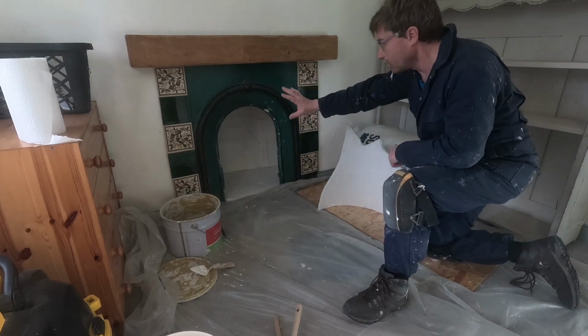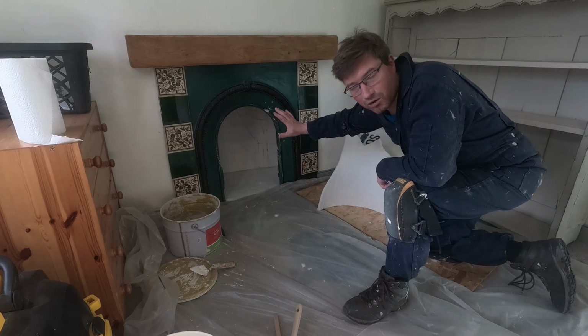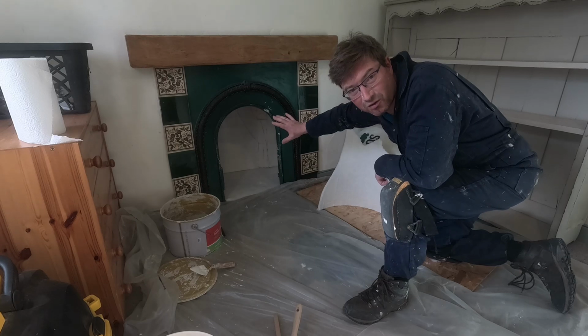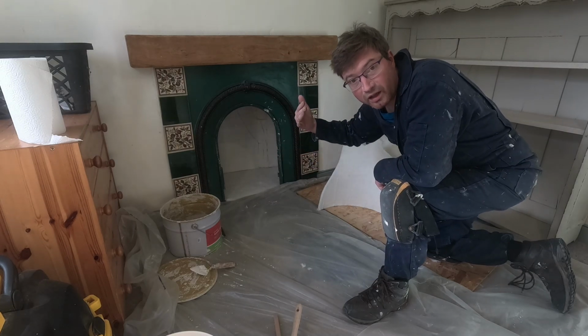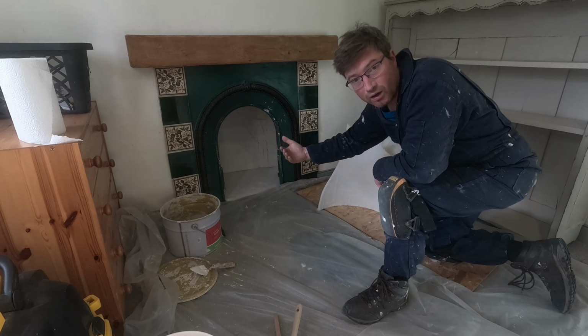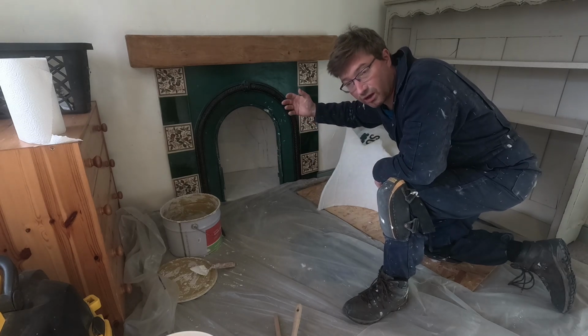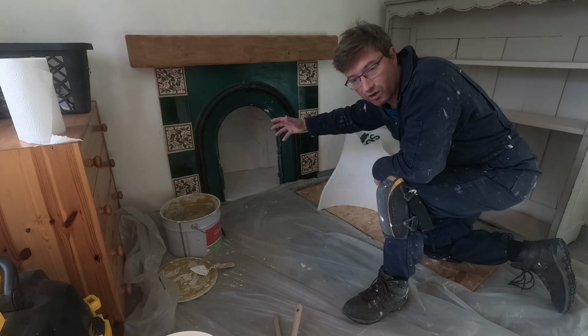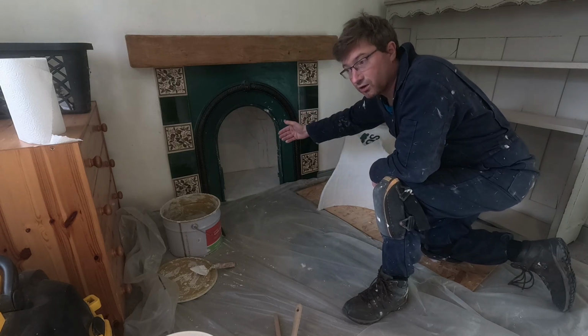but inside here it's not as level as I would like, and so I've had to make lots of cuts in the aerogel in order to get it to actually be in contact with the wall behind everywhere. If you don't do that, you get air pockets. When you get air pockets, they're cold, and then you get condensation, because moist air will move through and condense.